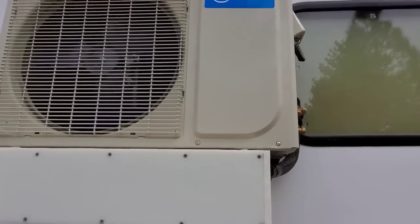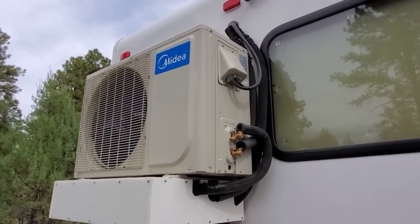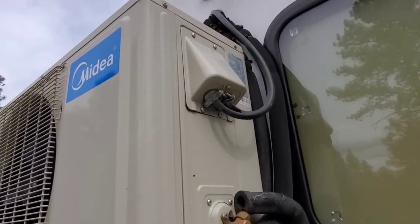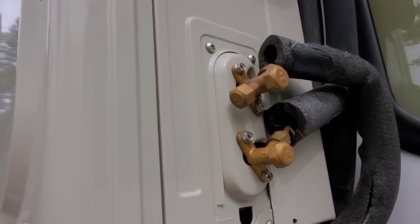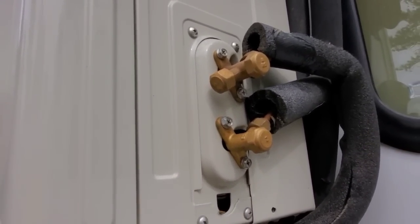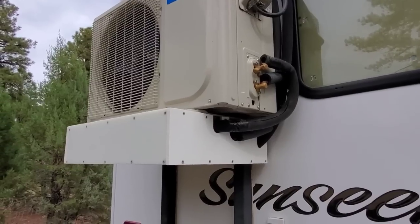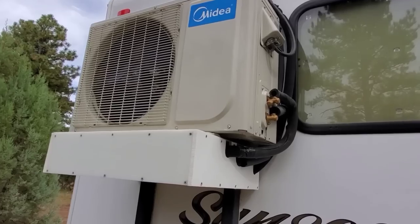So when you receive your unit, all you need to do is connect the refrigerant lines to the inside unit and then mount the inside unit. Then you mount the outside unit and connect the copper lines, and then connect the line and control line wires to the wiring terminal. Then you turn the two needle valves located where you connected the refrigerant lines to the outside unit, which will pierce the copper lines and allow the refrigerant in the outside unit to fill the entire system. That is how the entire system is installed and charged with refrigerant.